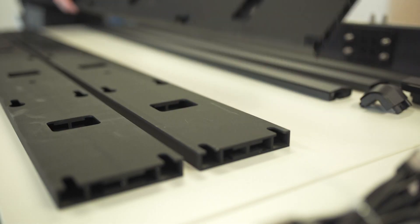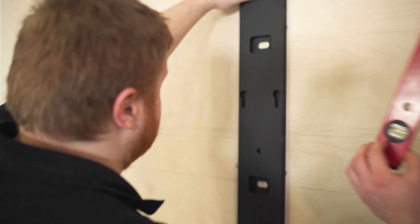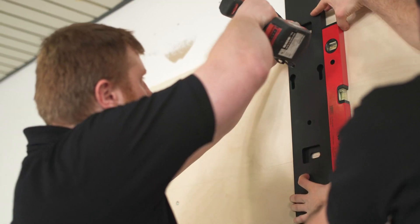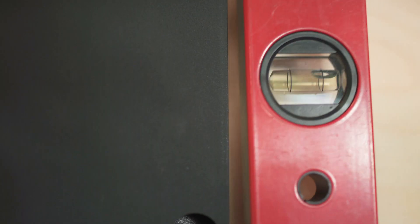When installing an LED wall, pay great attention to the evenness of the back wall. Make sure the brackets and bars of the frame are set evenly and are perfectly aligned. This will save you a lot of trouble once you install the pixel cards.